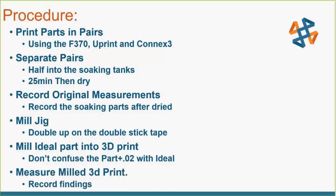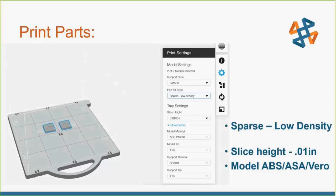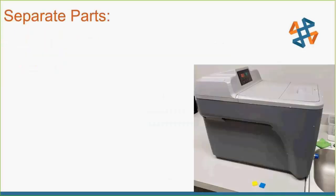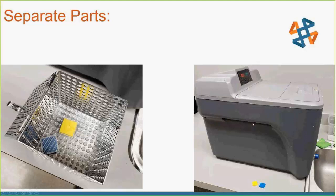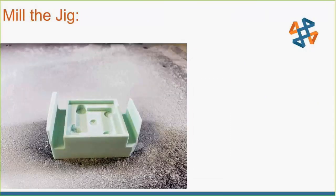We mill the ideal part — the part without the extra 0.02 inches — and then remeasure the milled parts to see what happened. We printed the parts using GrabCAD with sparse low-density infill, 0.01-inch slice height, using ABS and ASA for the FDMs and Vero and Digital ABS for the PolyJets. Once separated into bins, a tip: if you're using a wash tank, use a small collector basket for small parts otherwise they'll get lost. After washing, lay the parts on a paper towel — it helps wick moisture out, and after sufficient time they're dry.